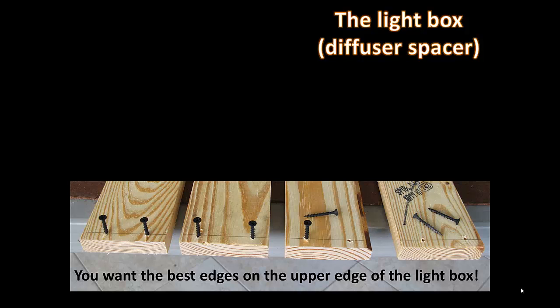Okay, so before you actually do that, though, apply the construction adhesive, then align the overlaps even and flat to the surface while pressing the sharp points into the other board, and then drive the screws in until the head of the screw is flush or slightly recessed.